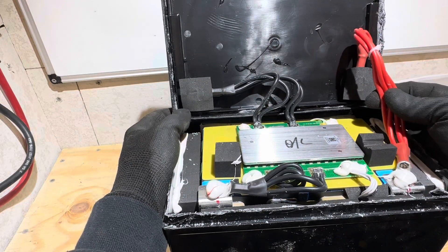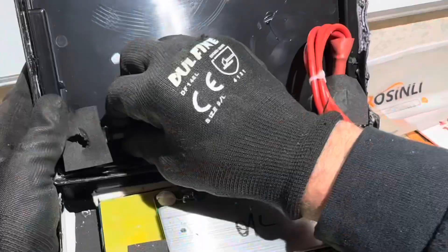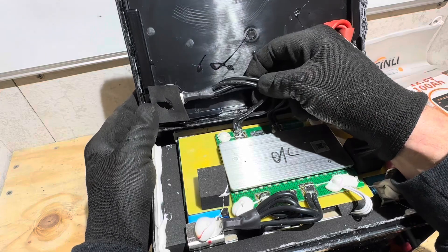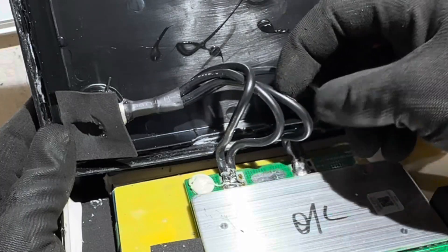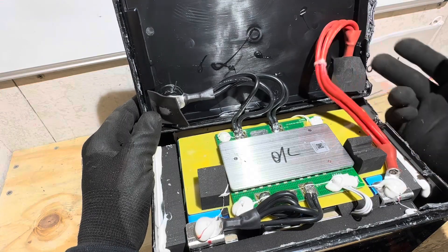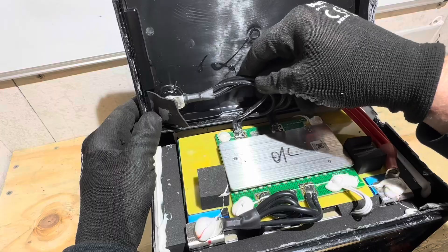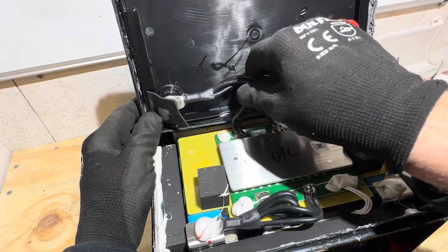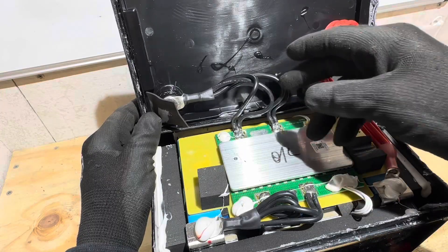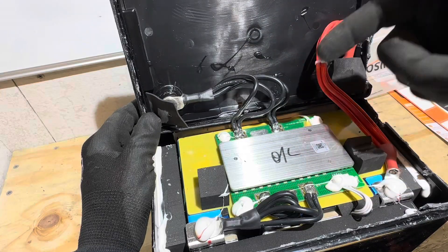Let me reposition and go over everything I'm seeing. Going over the wiring first on this battery — what I'm seeing is a little unique compared to some. Everything is tied on the top of the battery. We've got four number 12s on the negative and four number 12s on the positive to a hydraulic connection on the positive and negative terminal. I've not seen a manufacturer use four 12s — it's usually a couple of sixes or a single four. I'll get you an ampacity comparison or wire conversion to what four 12s are equivalent to on a slide in just a second.